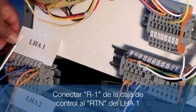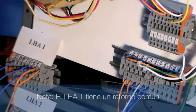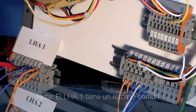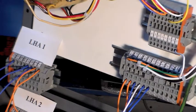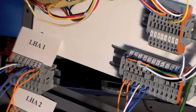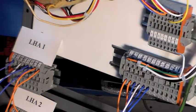and in this case, the box designation, when you look at it, there are three returns. All three are jumpered together because we're simply using one wire for the return of all three lamps. This we'll just put in the center return because all three are jumpered and are common.